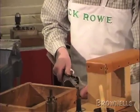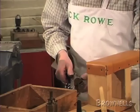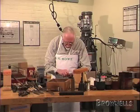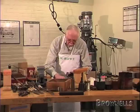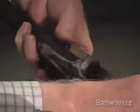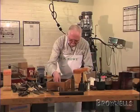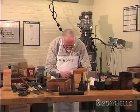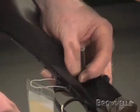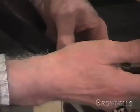You can tap the front end of the action on the bench and the lock should come out. Now these are a bit tough, so you can use the lock plate pin — screw it in on the opposite side — put a drift in through the hole and give it a little tap, and out comes the lock. You can also get a drift or a punch and push it through the hole in the stock where the sears go, and give it a little tap and the other side will come out. Usually by tapping the end of the action, the lock will come out.